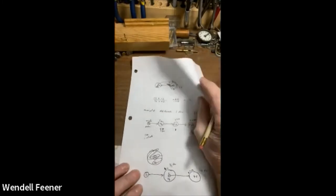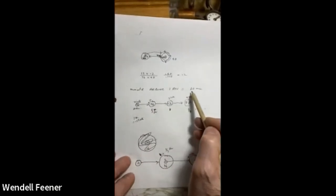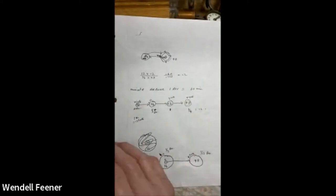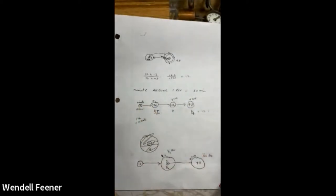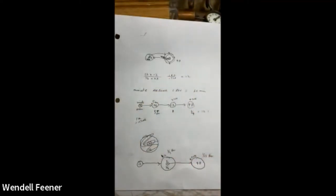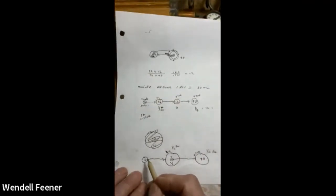So these are some of my notes. Keep in mind that the minute arbor has to make one revolution in exactly 60 minutes — there's no give or take if you're having accurate timekeeping. All the gearing in the clock is designed to cover that. On this minute arbor there's a pinion — they're called pinions if they're small. If they only have 8, 10, or 12 leaves, each little tooth is called a leaf. Small ones are pinions; bigger ones are called wheels in clocks. This minute arbor has 12 leaves.